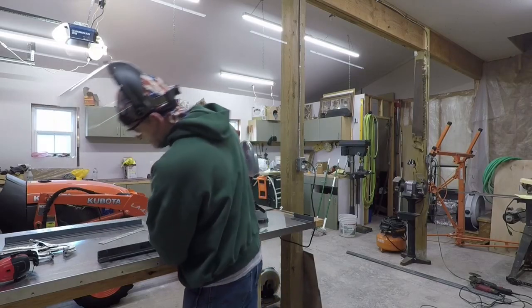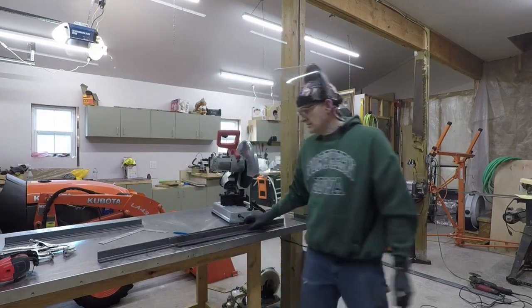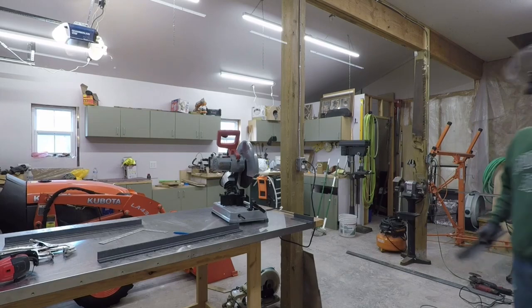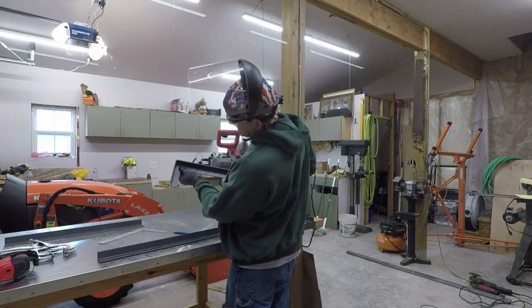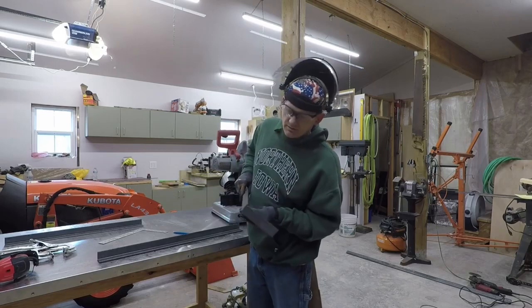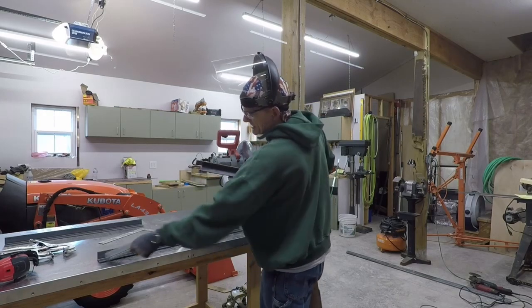And cut these notches out like this. So the next piece going up on the frame is gonna fit into that notch like that. That's how it'll fit up. I'm gonna have left an open corner here so I can weld up on that corner. So this is the notch that I'm gonna fit now.